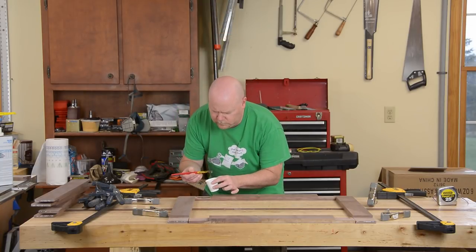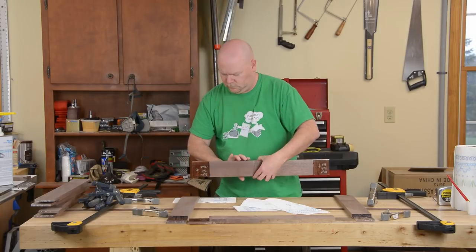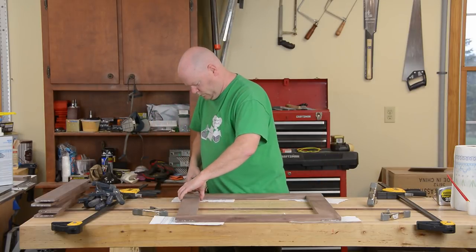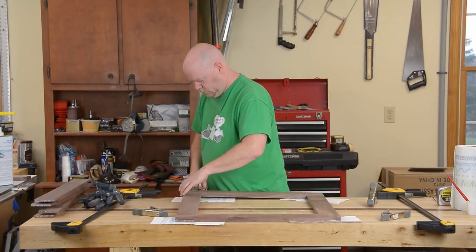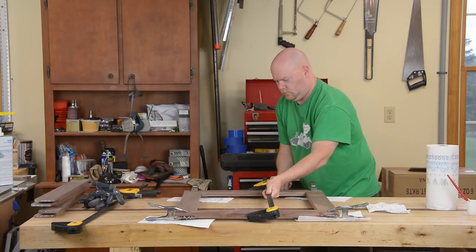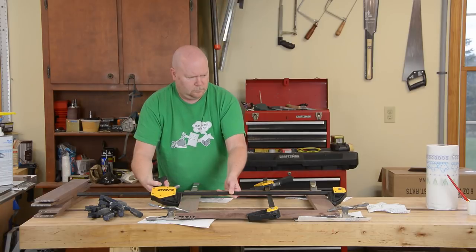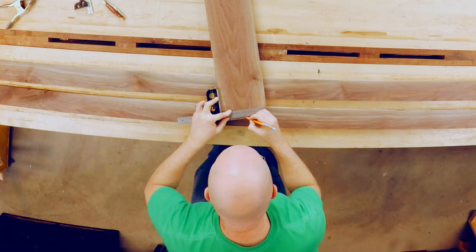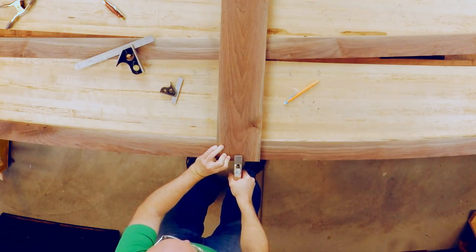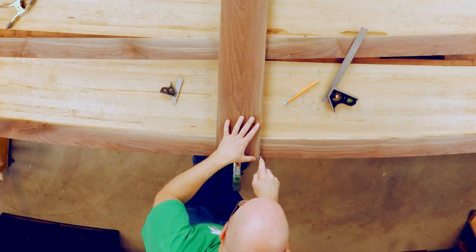Part of the reason I like working with epoxy is the viscosity — not too thin, not too thick. Goes on about like a high-quality latex paint, so it doesn't run around all over the place like PVA glue can. Clamping a half lap joint is a pretty simple affair: you need some pressure to pull the two faces together — spring clamps for now, F-style clamps after — and then a little pressure to pull the joints tight into each other. Layout for the long sections begins by finding the center point of everything, the rails and the middle board, clamping them all together, squaring it, and making knife nicks to mark the two outside edges of the half lap joint.